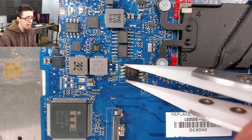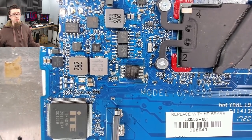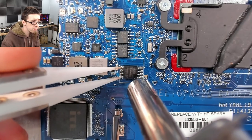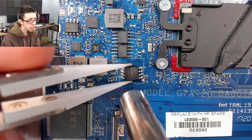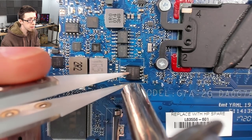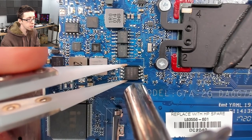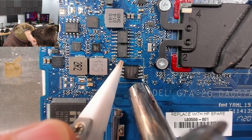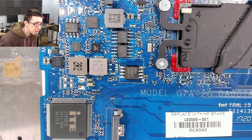I'm going to position the chip in there — we've got a dot in the bottom right for orientation. I've brought the airflow down to about 50% so we don't blow everything sideways, and I'll keep the chip in place while we heat up. This is the danger zone for knocking things sideways as you're trying to get the chip to sit straight. The solder's molten. Oh, it's being tricky. Come back. Can you be a bit straighter? Oh my word — all right, that's it. Good enough. There are no bridges, everything is soldered down. That'll do for me.